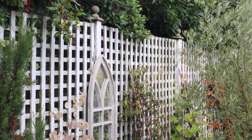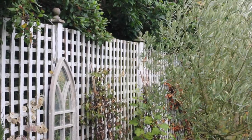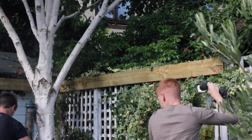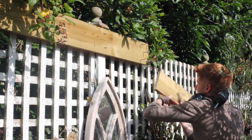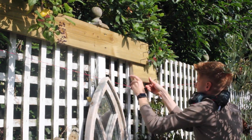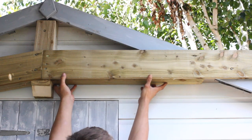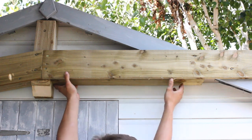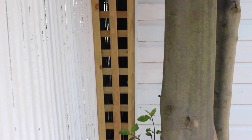To prevent any unwanted problems and ensure sufficient support, the fence posts should be 1.8 metres or 6 feet apart. If you're attaching the CatSecure system to a pre-existing fence that doesn't meet these standards, you should provide additional support between the cross rails and fill the gap between the fence and the backing board. The CatSecure team use a sturdy baton attached to the rails — this supplies a little extra support and prevents warping.